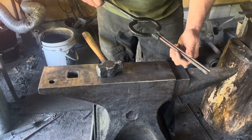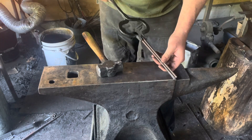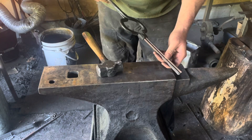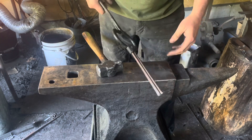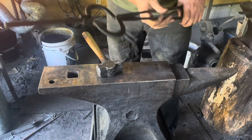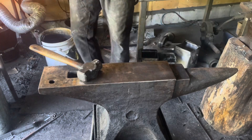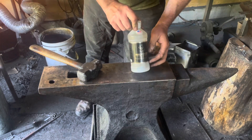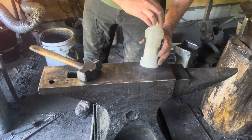We'll drop it into the river and drag along the bottom, hopefully to hook my lawn chair which I lost in the fall last year during a windstorm. As you can see, these bends are convenient — you can hold it together in the tongs, it's quite firm, not going anywhere. We'll be able to get a good forge weld on it in no time. Using a little flux — we've got the Iron Mountain variety here, it works pretty good.